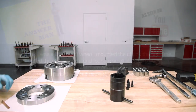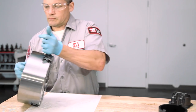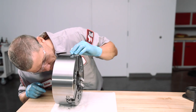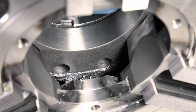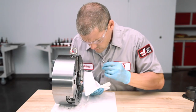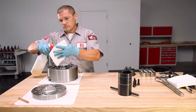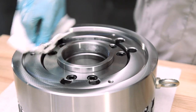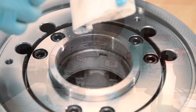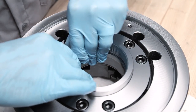With the adapter plate cleaned and checked, Andrew moves to the chuck and pulls the tapered wedge upwards until the rear face is just past the chuck body, then lifts the chuck upright. He checks both sides of the chuck body to remove any chips or debris found in the inner recesses, using tweezers to pull chips out of recessed areas and checking inside the range of Master Jaw travel. With all visible chips removed, he lowers the chuck body back onto its face, sprays WD-40 on the rear mount face, cleans it thoroughly, and checks for dings and high spots using the deburring stone. He then thoroughly cleans the draw nut threads and checks that the draw nut rotates freely from one detent position to the next.